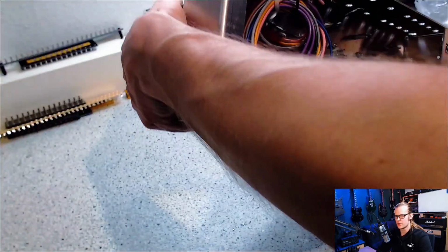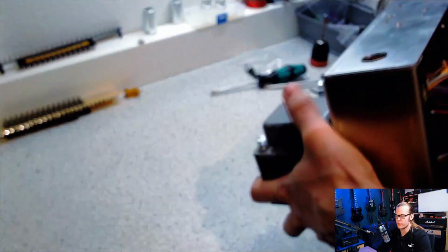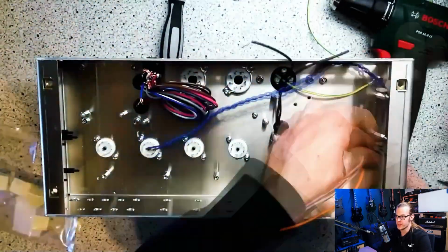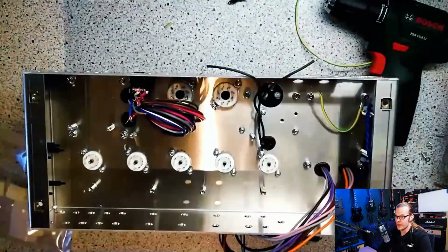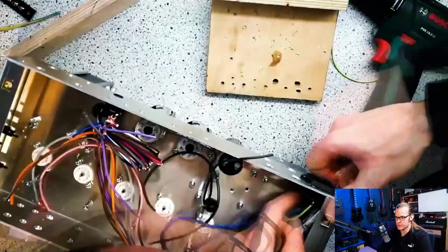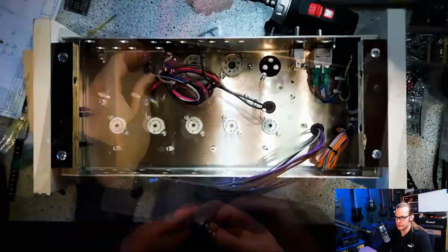This gives you a boost of energy, but there is still a lot of work left. So next would be the wiring. Okay, for the wiring you start with the power jack, because it's the first thing that has to be mounted well and grounded well.